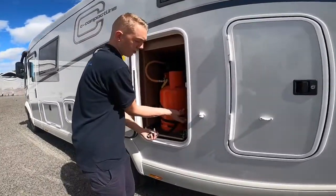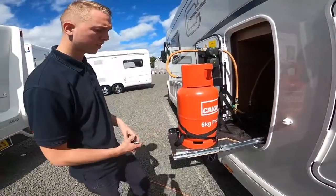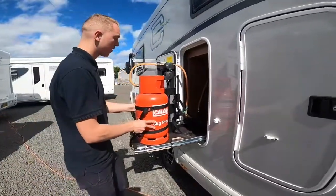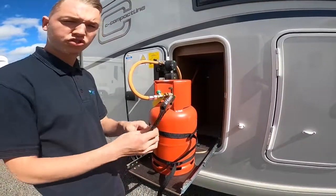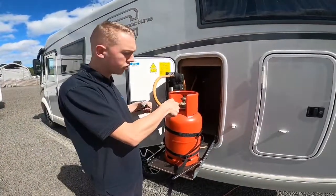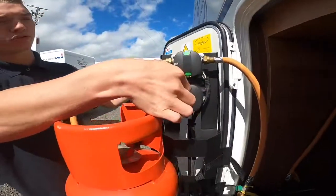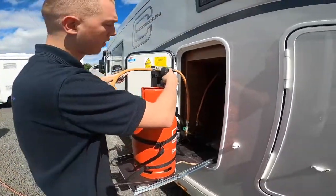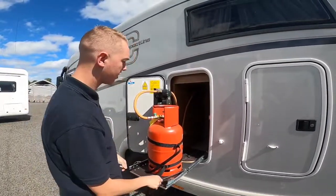On here you've got a slide-out rack — lift it up and you'll be able to slide the rack out, which makes putting two bottles on far easier. We've got our 6 kilogram test bottle on here. First thing you do is strap the bottle in top and bottom, then connect your pigtail — it's a left-hand thread — nip it up, get an adjustable wrench and nip it up before you turn the bottle on at the top. Press the green button to allow the gas through the crash valve. Make sure the yellow button on the regulator is pushed in, which is another crash valve. You can connect two bottles together: green means you've got gas, red means the bottle's been turned off or has run out and you need to swap to the other bottle.